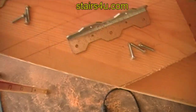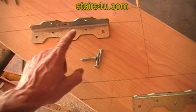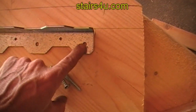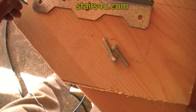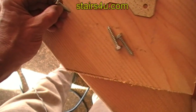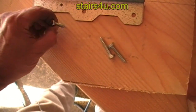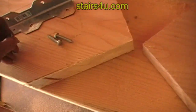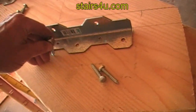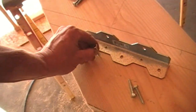If you want, get some small nails and nail the brackets in place before screwing in the lags — that's a good option. Because when you're screwing the lag in with an impact wrench, if it's even slightly off the grain it'll follow the grain and go in at an angle. The grain here is going this way, so it's not uncommon for the lag to slip and turn. I've had them turn and go in at a steep angle, and there's really nothing you can do about it.